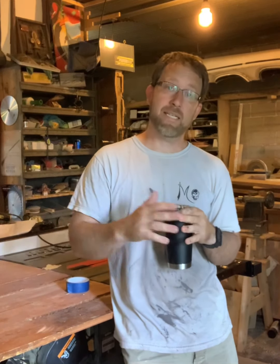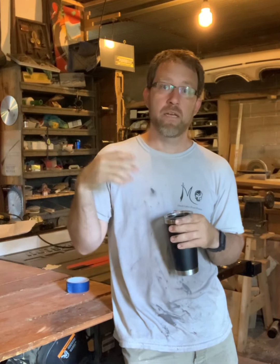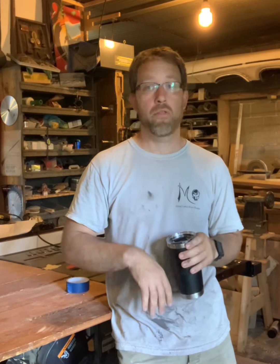That's right around a $14,000 job at my last estimate, which was like 4 years ago. Or it costs about $600 if I do it myself and I'm the manpower. So there'll be a video of that. Once I take out the mortar, then you repaint it and then you put your mortar back in. That way your mortar doesn't have any moisture content in it, which would cause the bricks to crack again.